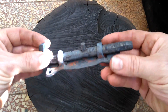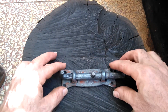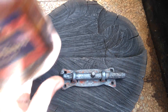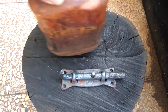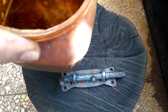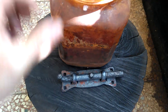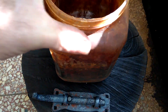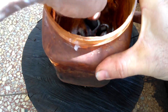I've got the sliding bolt that I made here, and I wanted to just let it rust. To speed that up, I'm going to dump it in a bath of vinegar. In this container I've got some rice vinegar — you can just use distilled white vinegar, which in the States is made from corn. This is rice vinegar from Taiwan, but it's very similar — just a weak acid basically. So I'll just plop that in and make sure it's submerged.